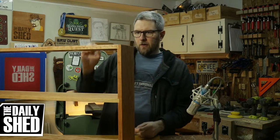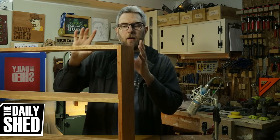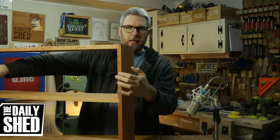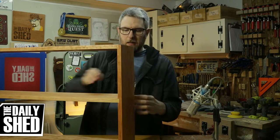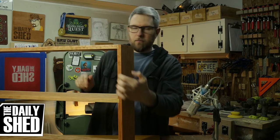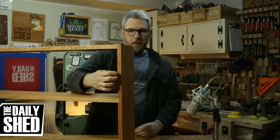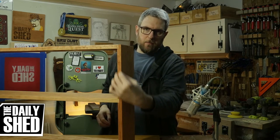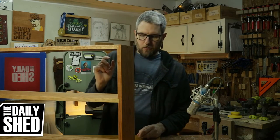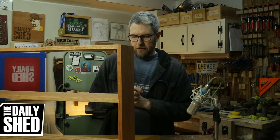I did make them robust though — they're three-quarter inch, from four-quarter cherry, all solid cherry, planed down to three-quarters of an inch. The shelf dimensions are sized so I can mount them between studs, with the center of each outside board exactly 32 inches apart. I'm going to drill keyholes in the verticals and hang them by the verticals, and then the books will sit in here.